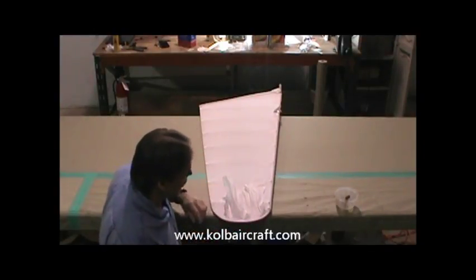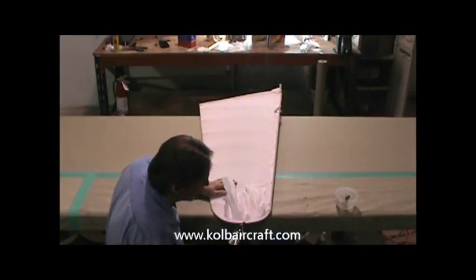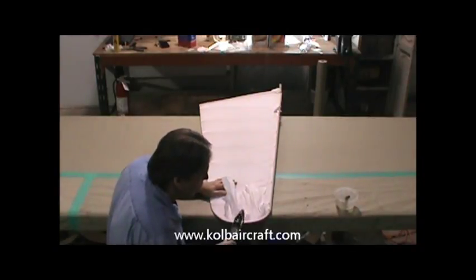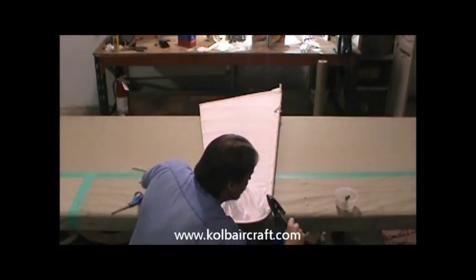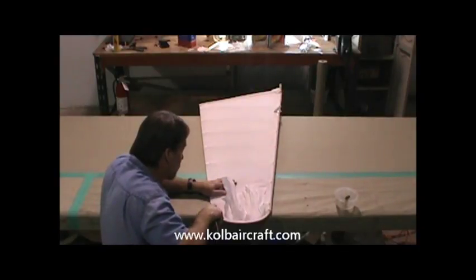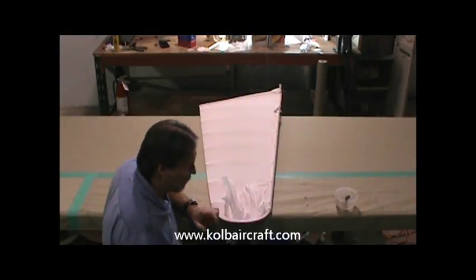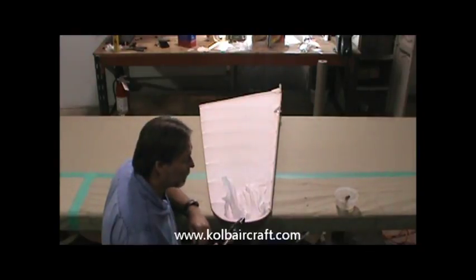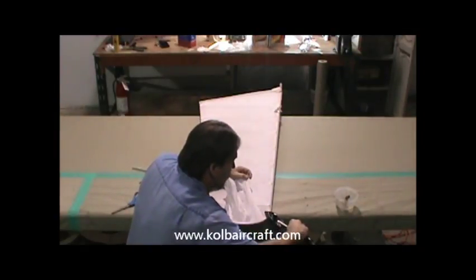Now I'm going to go ahead and turn my iron up to about 350 degrees. While I'm waiting on it to come up, I'm just going to go around and touch up some of these edges. It's still showing a little bit of wrinkle in there. We're just waiting for our iron to come up to temperature so we can shrink this the rest of the way around. Now, I already know where my iron goes to be at the right temperature. I've preset everything, but you know, you can check it with your heat gun. Every once in a while, make sure you're in the right spot.